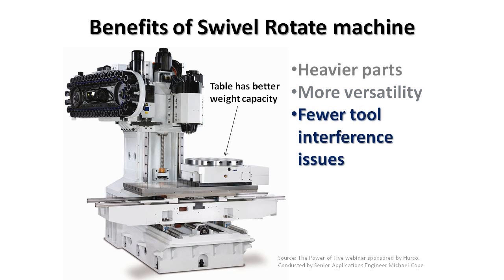With a swivel head machine, you're going to see much fewer tool interference issues. On a trunnion style machine, when the part tilts towards the operator, the spindle comes from behind the table. If I'm going to reach out over the casting of a trunnion tilted at 90 degrees, I need to bring the Z axis down with the tool on the spindle to contact the part mounted very close to the center of the table. Smaller parts accentuate that, and at some point there's an interference issue between the bottom of the head casting and the trunnion itself, causing the need for much longer tools or impeding machining of smaller parts on larger trunnion style machines.